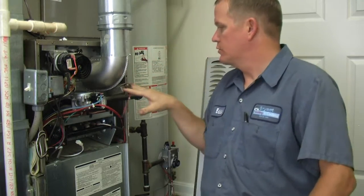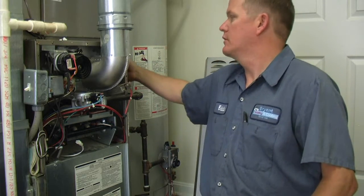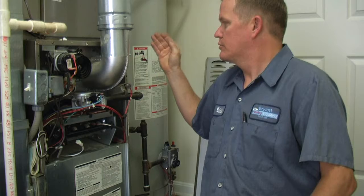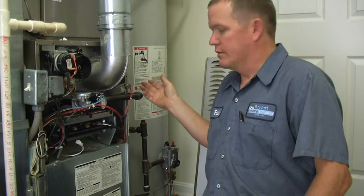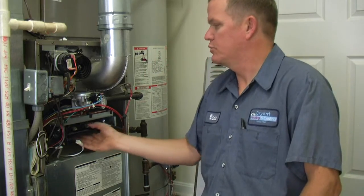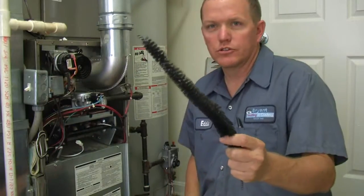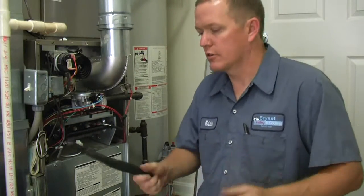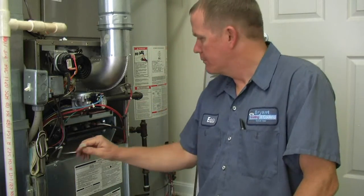The union to get this loose so I can get the manifold out is in between the furnace and the water heater and it's very tight. Superman put that union on — it's really tight. I need a pipe wrench and I don't have one to get it loose, so I'm going to skip that step. Normally you would pull the burners out, use a burner brush, stick it in and just clean it out real good. Put it back together.